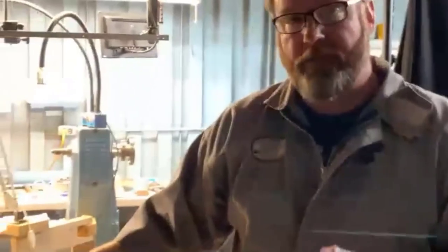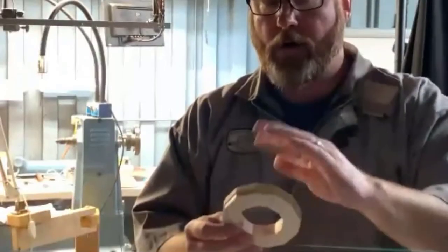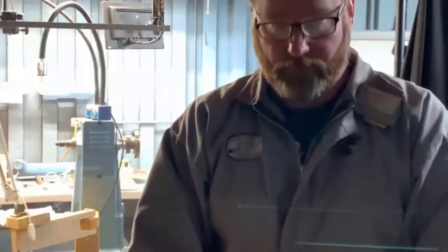You're still going by your eyesight, and you might notice that I'm unfortunately having to wear readers, getting older. So maybe I don't have that blade perfectly vertical or perpendicular to the saw table. Or especially since I had to modify my wedgie sled to fit on Ron's table, I may not have my wedgie sled perfectly flat on this table. So by flipping the segments, alternating back and forth, as Ron said, that negates the angular inaccuracies that we might have.